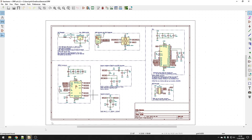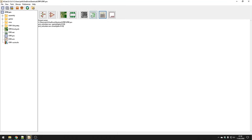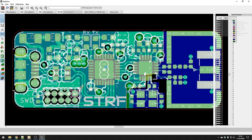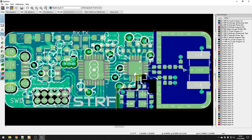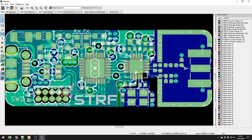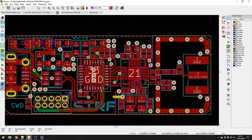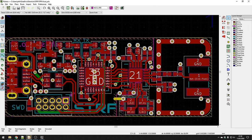One last thing I always do is a Gerber viewer check — just to make sure KiCAD has exported the files properly. Load all of them in, go through every layer to see if all the copper fills are correct, vias are in the correct place, the board outline is okay, and so forth. Once you're happy, send them off to your fab house, and then it's time to test the device when it arrives. I hope this has been helpful as an introduction to RF and high-speed signalling layout with USB, STM32, and NRF. If you have any questions, please leave them in the comments.